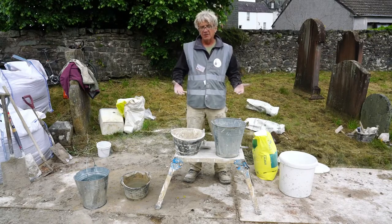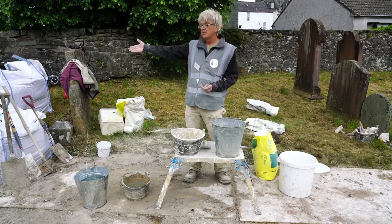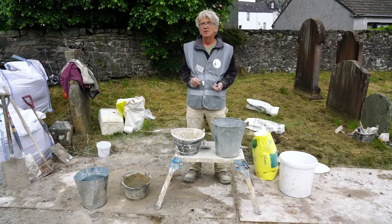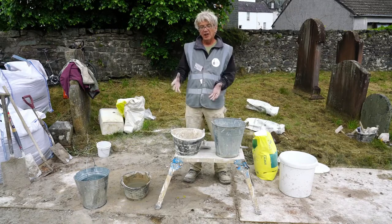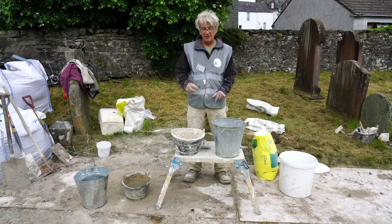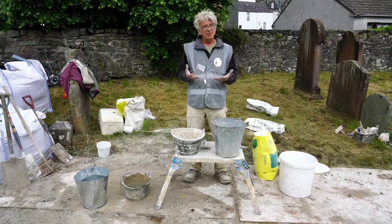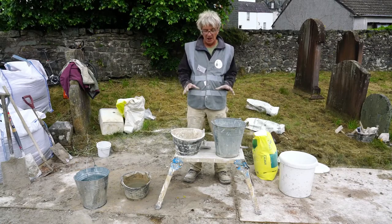And when we've done days like this, often I get challenged, well, will it hold up coarse sharp sand? And I can tell you, yes it will. That won't sink straight to the bottom. Beyond that, if you let it go cold, over a couple of weeks that aggregate will sink down to the bottom. But even though it's cold by then, stir it up and that will remain up in suspension again. So this property is coming from the process, as it is with hot mixing.